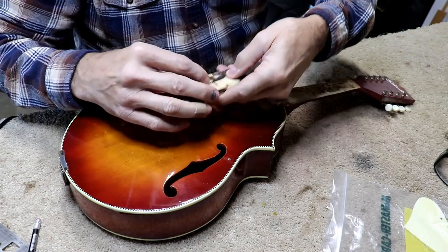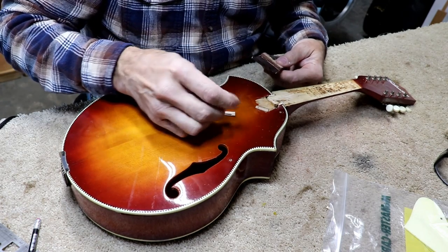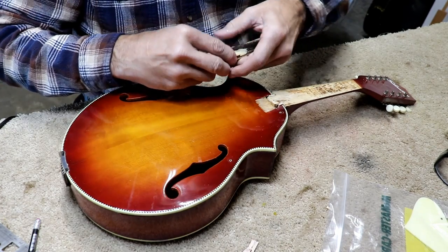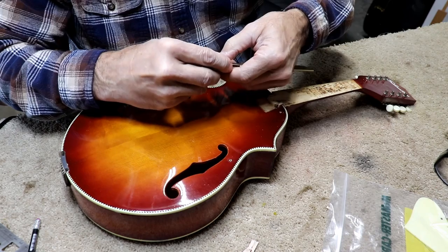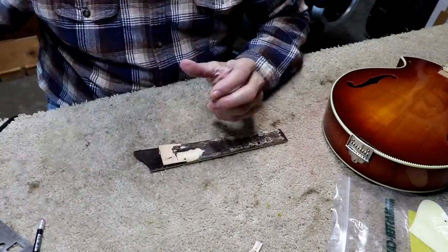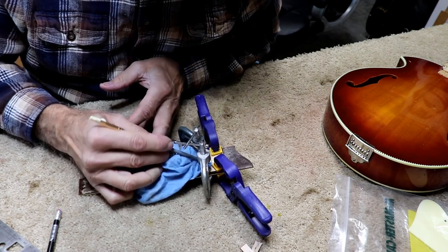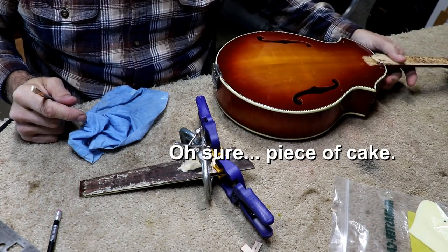I see it's not going to go all the way up because of the piece I put in there, so I'm going to have to notch a little bit out of it. Because it's a fairly square little notch, I'll just go cut that out on the bandsaw and that'll save me some time. I've notched out the little piece - it looks good. I'm going to glue it to the fretboard first because there was some tear-out and it registers back in that tear-out spot. I believe that fixes it up real well where it should go back together just like factory.